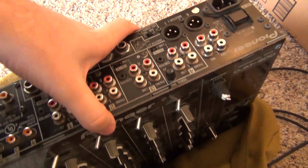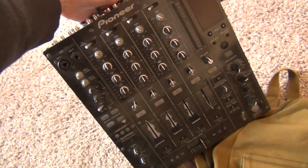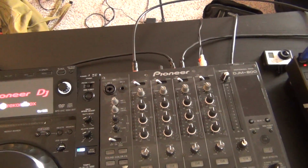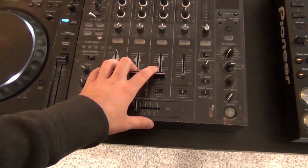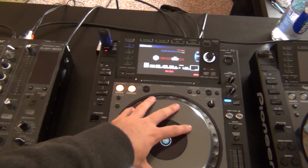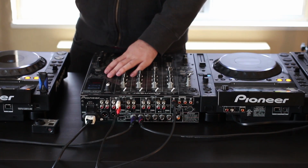And yeah, so the first step whenever you want to troubleshoot someone's broken gear is to plug it in and do a full feature test. So basically what I'm going to be doing is checking all of the inputs and their different features one strip at a time with a unit that we know is outputting good solid signal. So power this guy on.